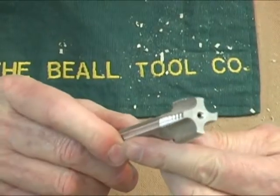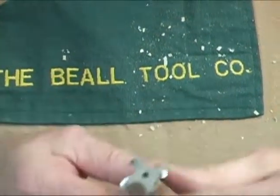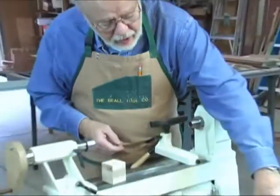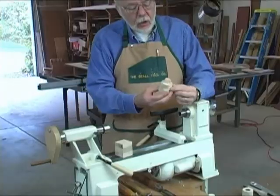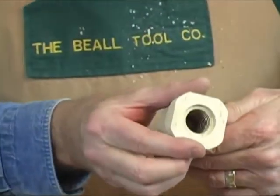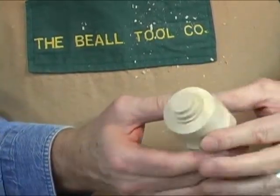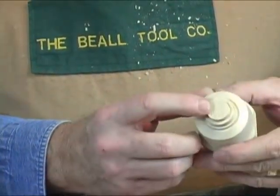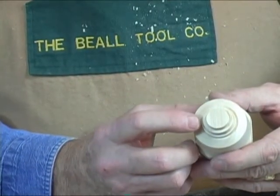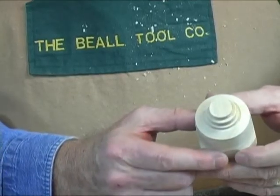It's very nice to be able to take a block of wood and drill it, tap it, and then screw it directly onto your spindle. I have one right here that I made a little while ago — this is a jam chuck that's all threaded and ready to go on the lathe. On the outboard end I have two different sizes: a three-quarter inch one and a one inch, and I use those for making salt and pepper shakers.